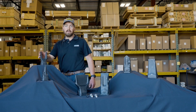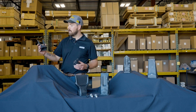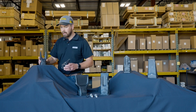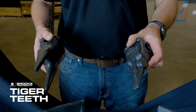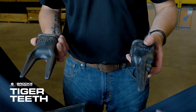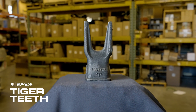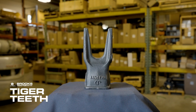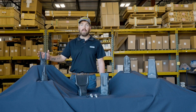The last two teeth we have here are the Tiger Teeth. We have your standard Tiger Tooth and we have your twin Tiger Teeth. They're not as common, but they work very well for very compact material. So if you're working in hard clay or a very tightly packed dirt, they're a great penetration tooth and will really help you break through that well.